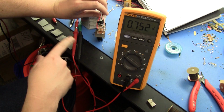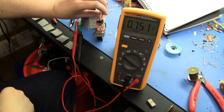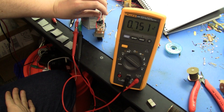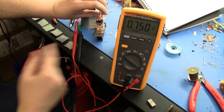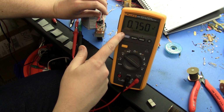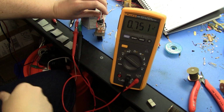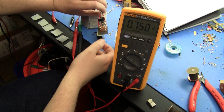This is obviously loading it in the probably nanoampere kind of region, so even incredibly feeble batteries will come out with essentially their open circuit voltage, and you can ignore their internal resistance, which is what we want. You have to multiply this obviously by that scale factor of 1.103, but for our purposes bigger is better, so it doesn't really matter. Relative is fine.